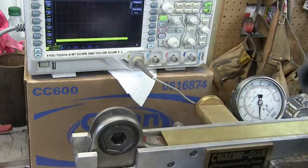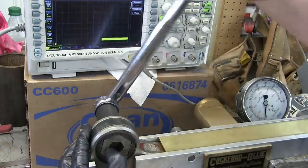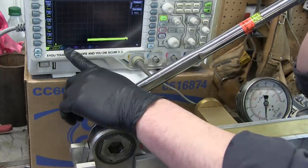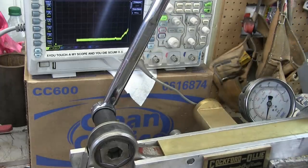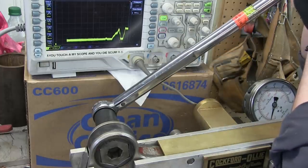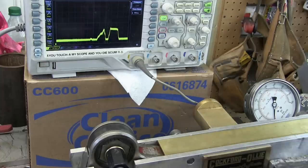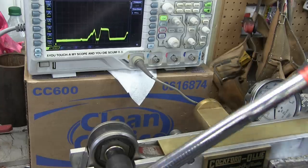It helps if you go the right direction. Because my sensor is on a field I/O, it's battery-powered, which means we have to sync and calibrate it every time. I'm going to torque this bolt — a well-lubricated bolt — up to 100 foot-pounds. The baseline here is 514 millivolts. There we are at steady state 100 foot-pounds. We'll very quickly swap this over and see what it breaks free at, and then compare the two.